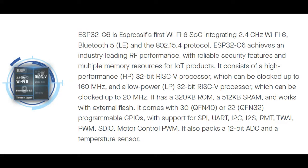It's also a super low-power processor — kind of an update to the C3, which we've used. It definitely has more RAM; the C3 was a little bit lacking, so it's nice that they bumped it up to half a megabyte of SRAM. You do have an external Flash chip, but the modules come ready to go with QSPI Flash memory inside of them, and the module we're talking about has four megabytes of Flash.